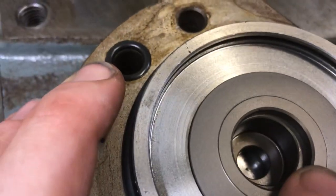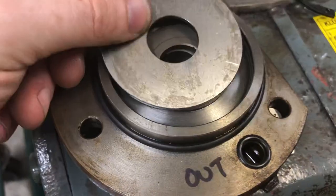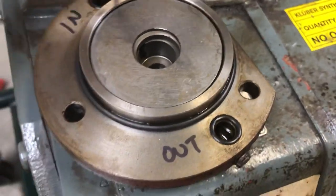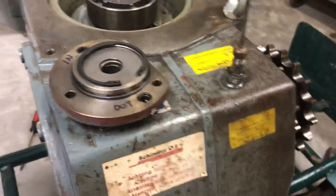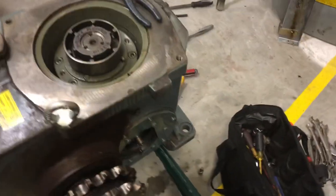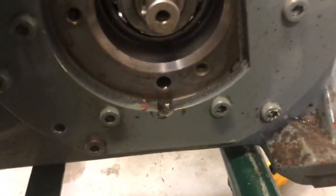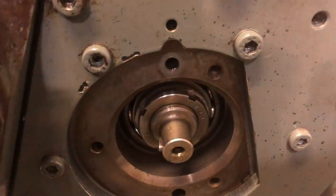You can see how that just flips one way then the other — pretty slick little setup. There's a snap ring for this little gearbox here. It sits down on the bottom, pulls oil in from the bottom via that little keyed shaft, and pumps oil out the top.